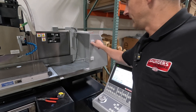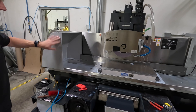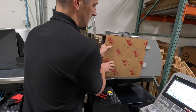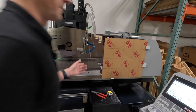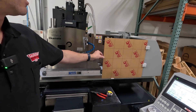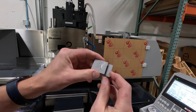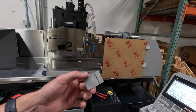These are holding pretty darn well, so I think the two that came loose earlier just weren't cleaned correctly — I'll redo those in a minute. On the linear rail, the sheet here will be semi-permanently clipped in. Slide that in — kind of a snug fit, just like so. I'll probably do something additional to constrain that, but for now that's okay. On these 3D printed parts in Fusion, there's a small flexure to give it some give, plus a little dimple in the middle so you're pressing on that point and don't need absolutely perfect tolerances.